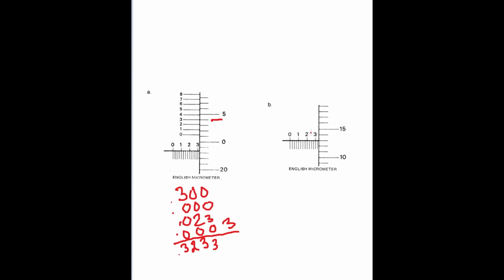This one, another English micrometer, doesn't have the Vernier scale to get us into tenths. So we look at it immediately. First there's a 3, so you know we add 300. Then we look at how many lines we see. We see 1, so we add another 25 thousandths. And we look on the thimble and we see it is at the 13 mark, so we add another 13 thousandths. Adding it all together, there's 8, 3. So we read this micrometer as 0.338 inches.